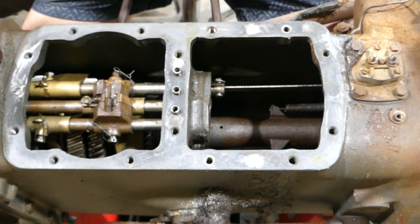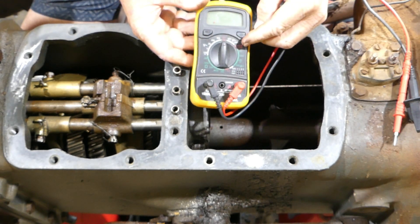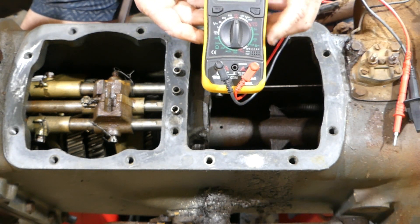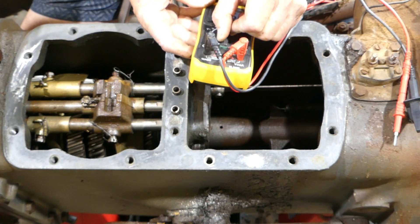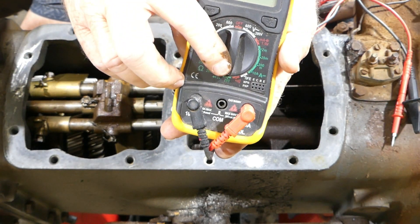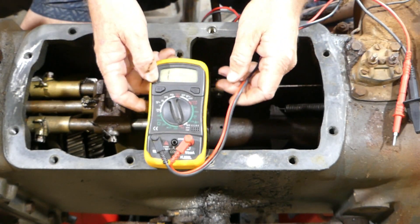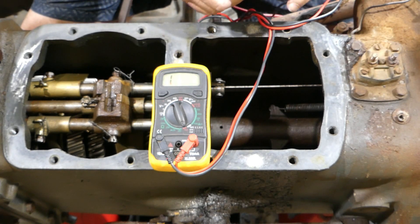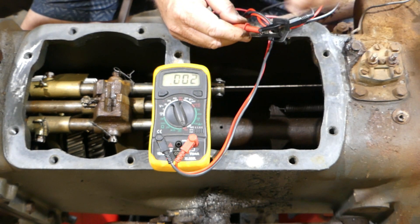The quick test I can do for you — I'll try and do it upside down so you can see — is get your metre here, your digital multimeter, and that little ohms signal down there. You can see the shape of it, it's a circle with two flat feet on it. A lot of them have a little speaker. If you click it to the speaker, it gives us both a reading. The reading of one means there's too much resistance. When we join these wires together, you have an audible sound and a reading here.